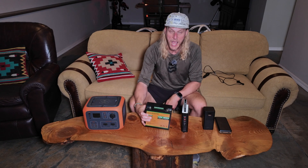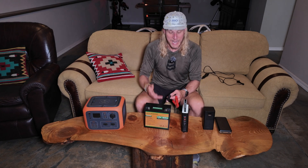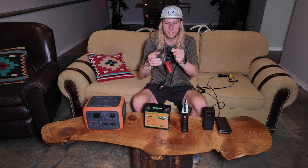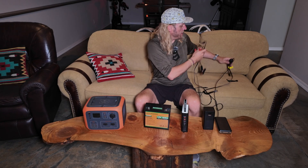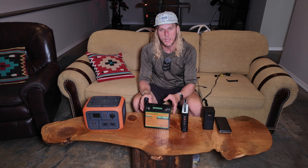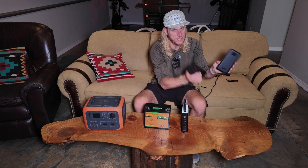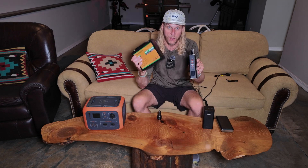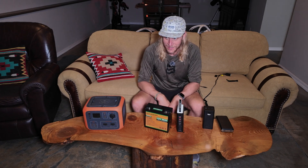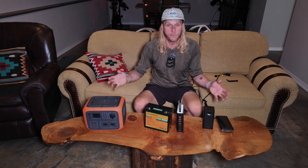The cord is only about twenty dollars and has an inline fuse, and the cigarette adapter to USB also has a fuse in it — so when using a raw battery, make sure you're putting it behind fuses to avoid problems. The integrated battery banks have protections built in. To summarize: I'd use the small and medium battery banks for hiking, medium and large for car or RV, and the solar generators just for RV base camp.